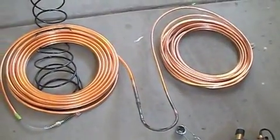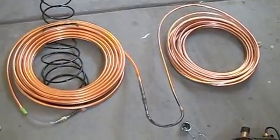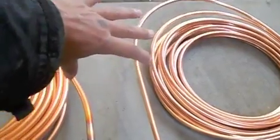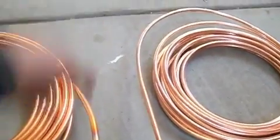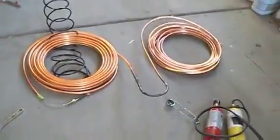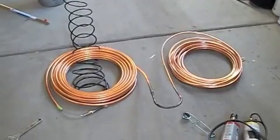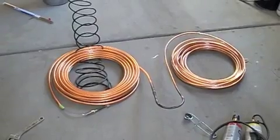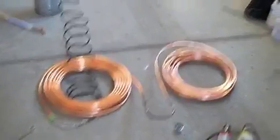So this is done. I'm going to start adding little bridges across here, and those I will join with plumbing solder. That way it keeps the pipes separated as I'm sending them down the hole. The next step is going to be to coat this with tar to protect it from acid and corrosion, and then send it down the hole — and that's what the next video will be.